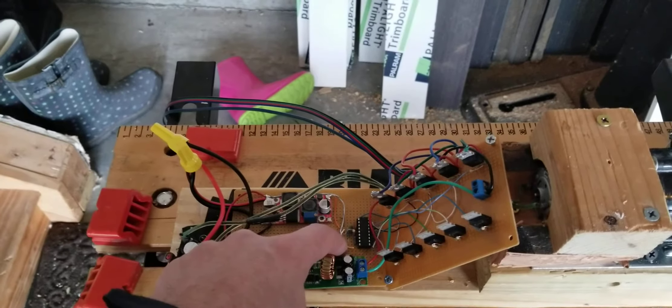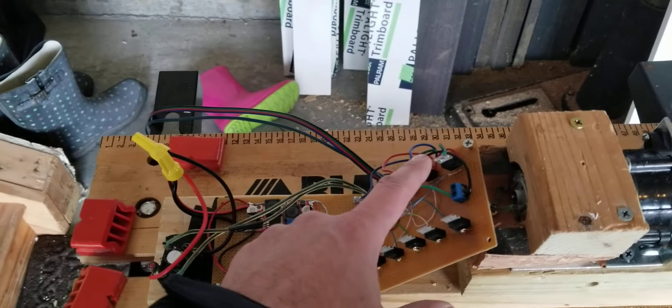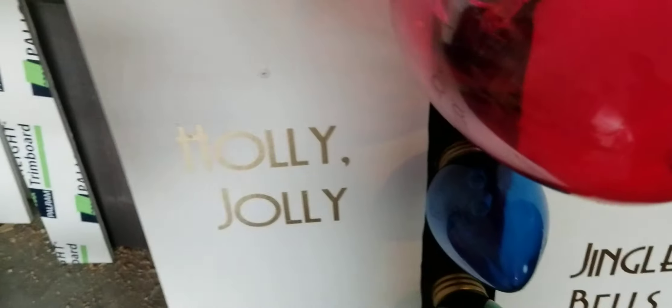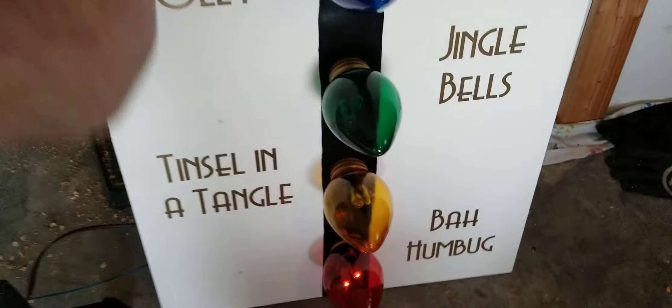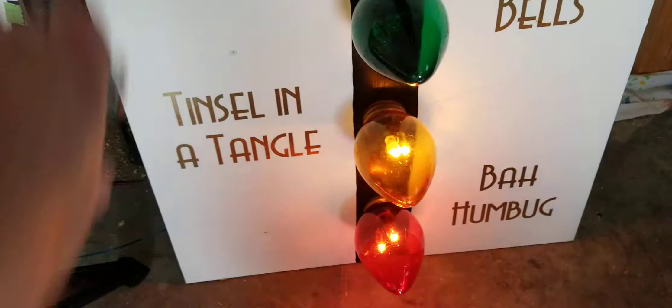So what I'm doing is reading off the power being fed to it, and it's lighting up more and more LEDs. These are just FETs here to turn on the lights. The lights are pretty straightforward — inside here they're little two-and-a-half watt bulbs. I'm powering them on 15 volts. I wanted it easy enough that any kid can get the bottom one lit just by turning the crank gently.